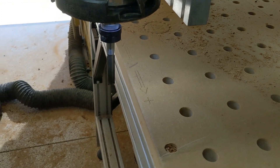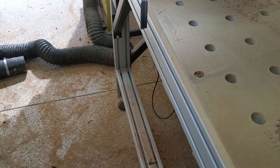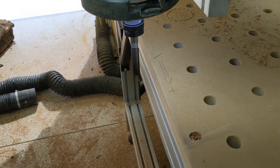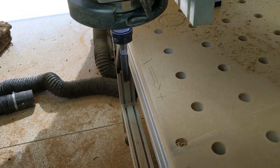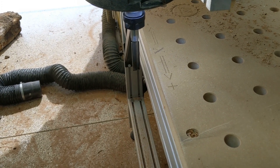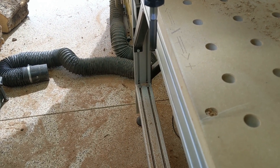This is really handy for that. I don't have to take my top off and go back to the second spacer support in there to do this. I can simply clamp something to the front surface here. And as long as I don't need to extend out more than about an inch and an eighth, which is pretty generous, that lets you do a spline on anything up to probably two and a half inches — that's getting to be a really thick tabletop. So that's a pretty good distance.